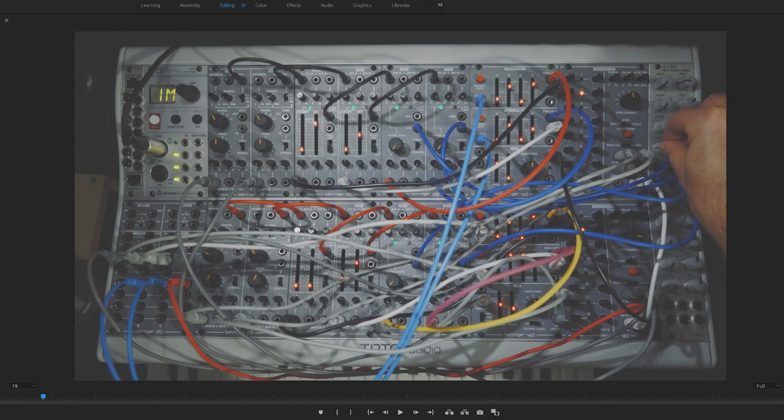The other cables that we've got going on here, which make it a little bit more complicated, is, well, we have to trigger those envelopes. All 4 of those envelopes need to be gated, need to be triggered, and it's our sequencers that are going to be doing that. Now, each sequencer module has got 2 sequences running to 2 different synth voices, but there's just 1 gate out because those sequences are synchronized. Both notes play at exactly the same time, and we have 1 gate out for each of those notes.